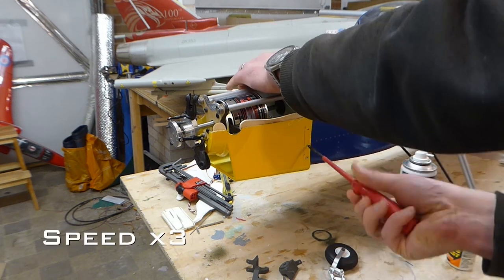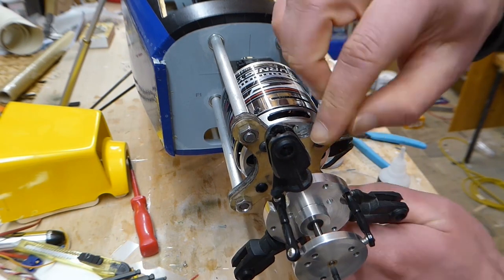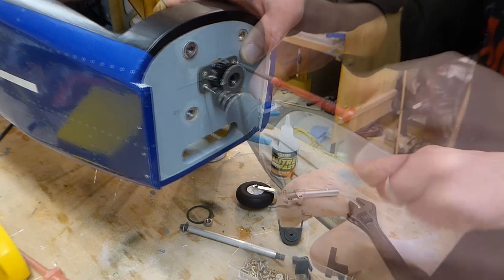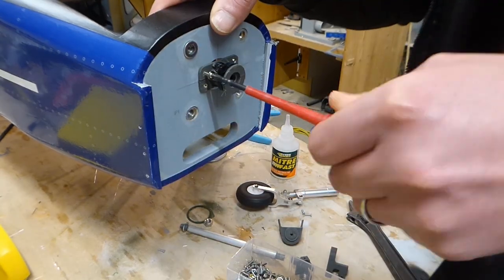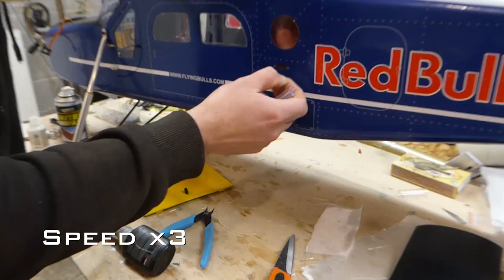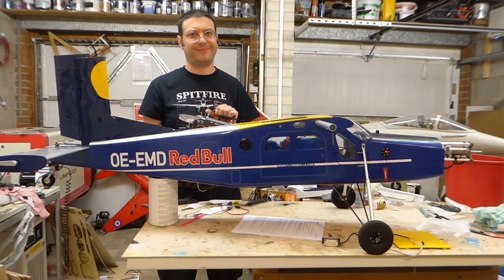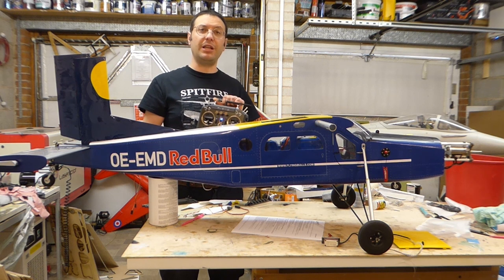To get all this in we'll start by taking the front of the plane apart. Here I'm fitting a new version of that bearing block I showed earlier. After removing the motor I can fix it with self-tapping screws, then reassemble the mount using threadlock and securing the wires so the motor doesn't eat them. Here is the installed electronic speed controller and the MCATEC isolator. The Jetty BEC supplies the receiver with power from a 2S lipo battery. Now that all the soldering is done and we've fitted the ESC mechanically permanently to the aeroplane, we can continue with the electronic setup.